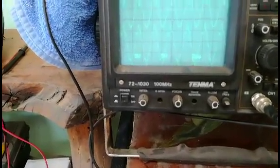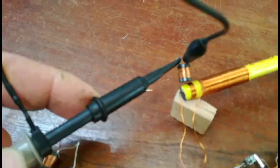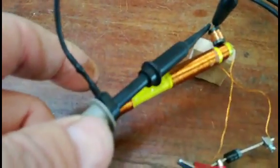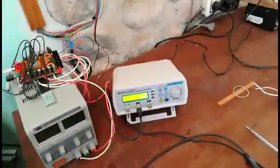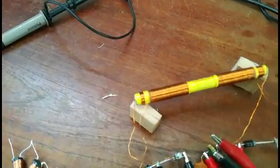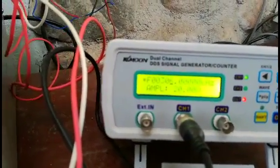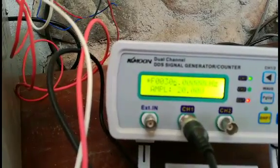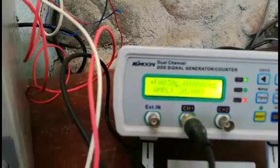There is a maximum. I'm all the time in a perpendicular position with the inductor. You can see here is the maximum and here is another maximum point, right at the top of the ferrite rod. Note that without the secondary coil, the resonant frequency went down to 306 kilohertz, from about 360 with the output coil over the ferrite rod.